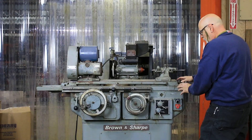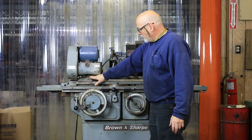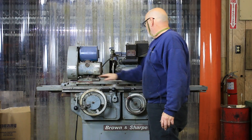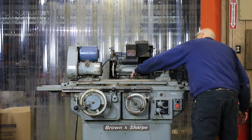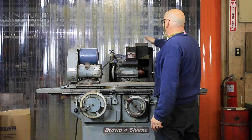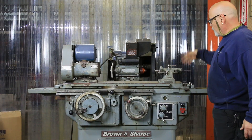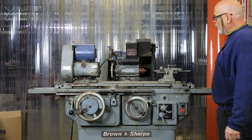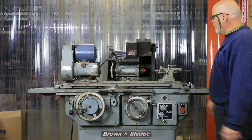You can set a taper for the swivel headstock, which can swivel here at the base. There's a wheel head slide which can also swivel here. We also have a fold-down internal grinding spindle mounted on the wheel head. And here's your tail stock. Right now I have the machine configured for external grinding.